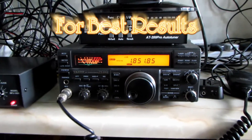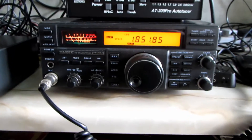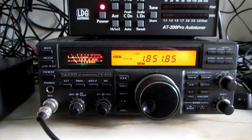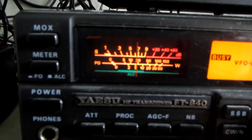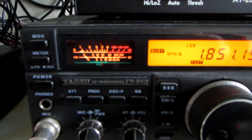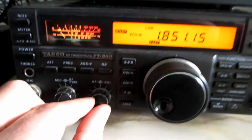You can do it with the button on the front but I'm not interested in using the internal whip. It's pretty good — it does take some getting used to and you have got to be patient and do some knob fiddling, but it does seem to work really, really well. It's not going to drop your S-meter all the way down to zero — it's just for taking out the noise unless you've really got some very strong local interference. I'll just give you a quick demo here. I'll turn up the noise — so we've got quite a strong local noise here. There we go, and we switch the unit in. There we go. There's a slight time delay — that has taken a lot of the noise away. That's just down below S4, but if there was a signal there you'd probably hear it under that.